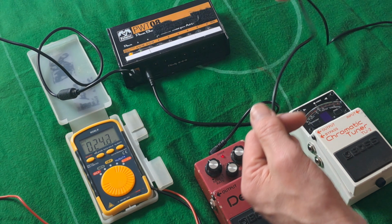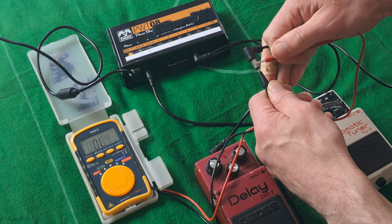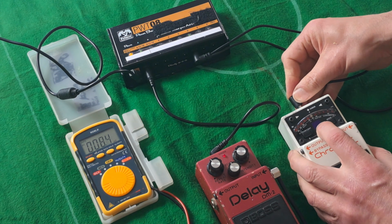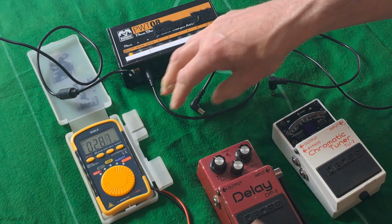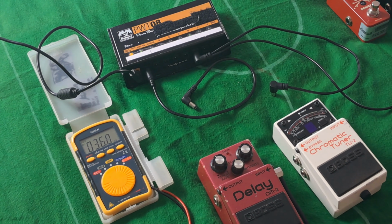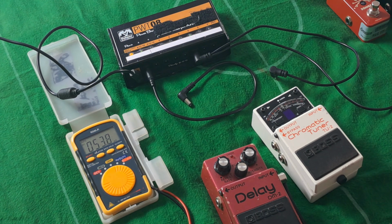Even these serial cables, you can just plug them in, 9 volt. Pretty sure that that's going to read 9 volts. Pin negative. So this one needs 9 volt, pin negative DC. That can be safely plugged in and it works. There you go. So it's all using your practice knowledge, and I would practice on the simplest of pedals. If you're not that familiar and you use effects pedals and you're used to 9 volt type pin negative effects pedals, I would practice like that all the time and really get used to it with a multimeter.